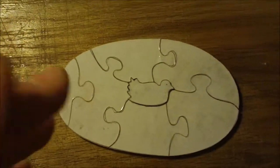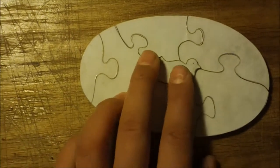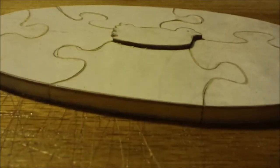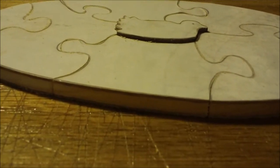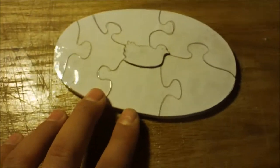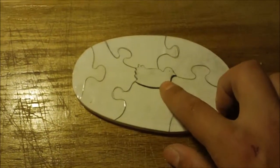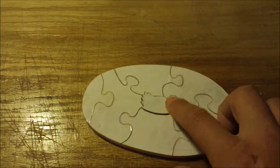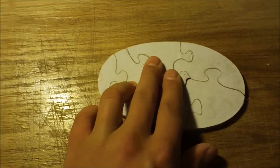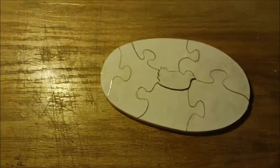It was a little snug, but we got it in there, and cutting exactly on the line paid off, and we got it to fit. Now, the difference here is that you can see it's a little proud from the birch, and that is because the birch is plywood, and they always undersize their measurements, and because I actually milled the walnut myself to quarter inch. So if we just sand that and make it flush, that way we ensure that it's all flat. But alright, that's good.